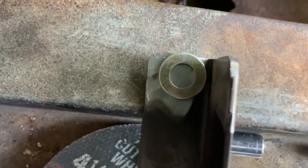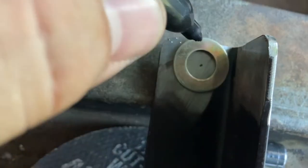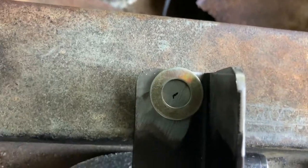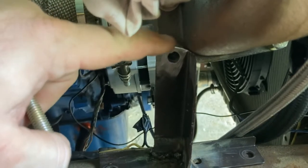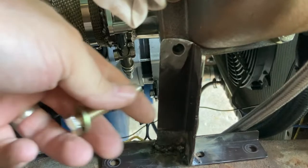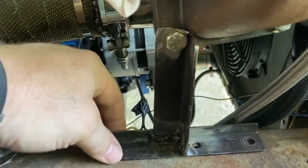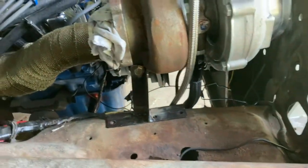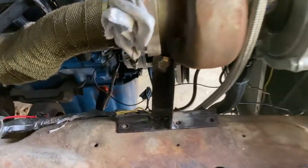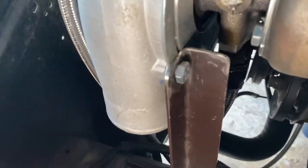Here's the washer that came off the housing — I'm just going to use this to mark where I want the hole, and I'll use my step bit to drill it. She's all done. I had to use the flap disc to sand it down a little bit after the step bit got the hole done. Now I'm going to center it down with these four holes — one, two, three, four — get her all painted up, then attach it and show you what we've got.